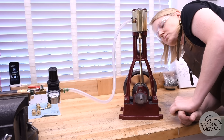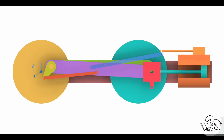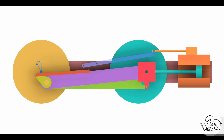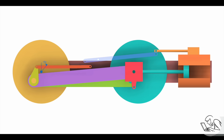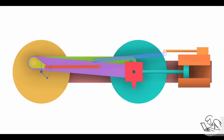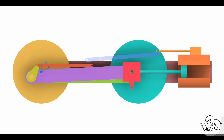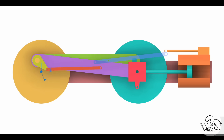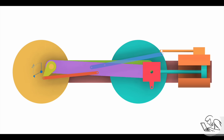Like we said at the top, locomotives need to run at different speeds, need to run efficiently at high speed, need to get going from a standstill, and need to be able to go in reverse. There are some other issues with this setup as well — the valve motion is quite poor quality. The valve events are not going to be crisp; they're going to be kind of mushy because the valve is sort of lazily sliding over the ports, and the valve is moving a whole lot further than it needs to because of the action of that return crank. We also don't have a good way to control the lead of the steam admission into the cylinder. Lead on a steam engine is very analogous to ignition advance on a combustion engine — the steam needs to get lead into the end of the cylinder a little bit before the piston gets there so the steam has time to get in there and start expanding, similar to how you need the spark to ignite a little bit before the piston gets to top dead center in a combustion engine.